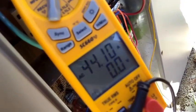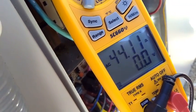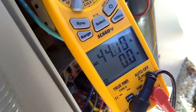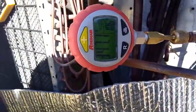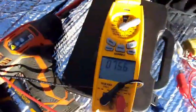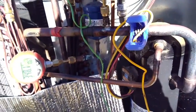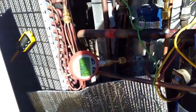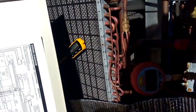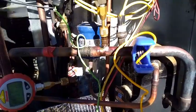We're going to go inside and start the SC660. We have 44 amps — our 10KW strip heat is working and rolling right now, so that's good to go. The compressor is on delay, so we'll let it go through its delay and then take our temperature split and see what our pressures are running. We have 52 degrees outside. 106 on the suction, 347 on the head pressure — hot gas, actually that's liquid. Return temperature 75.6, supply temperature 101, so we are pretty much on target — about a 25 to 26 degree spread, which is pretty good. That's what I'd expect from a heat pump at this temperature. They'll do their best between about 35 and 60 degrees, which is mild climates. I'll let it run a few more minutes to see if anything jumps out; otherwise we'll be wrapping this thing up.